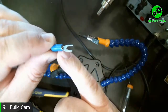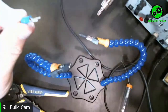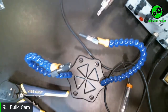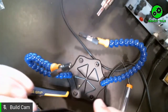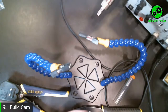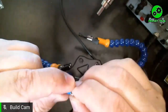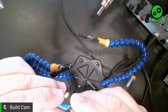You can actually heat this up and solder the wire to the spade bit as well, or you can just crimp it. It's up to you. I've done it both ways. Right. I have too, and I've also, without even crimping it, dropped in just a little bit of solder inside there and kind of sealed it up a little bit too. Yeah, and usually if I end up soldering to the bit itself, this ends up coming off, and I'll solder to it, and then I'll put a piece of heat shrink over it to replace it.